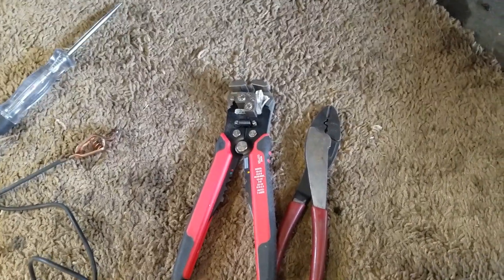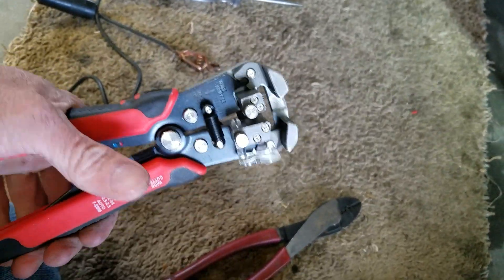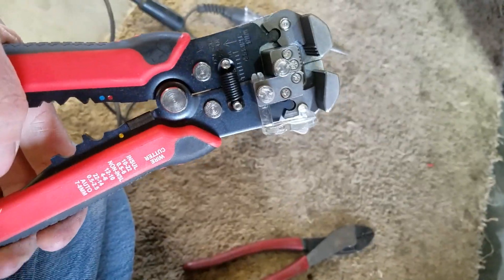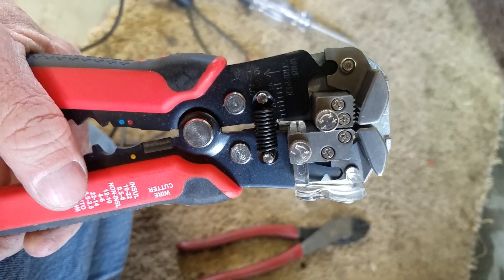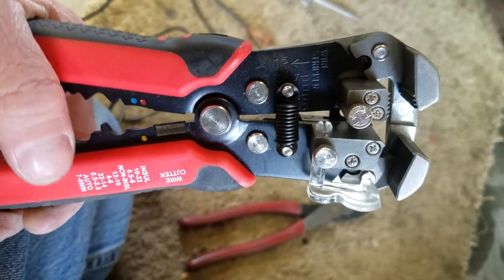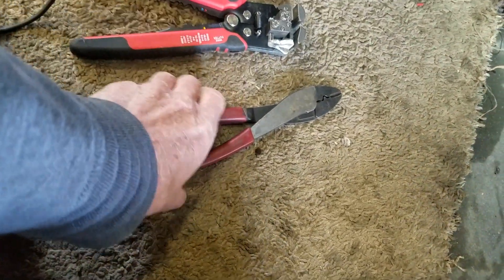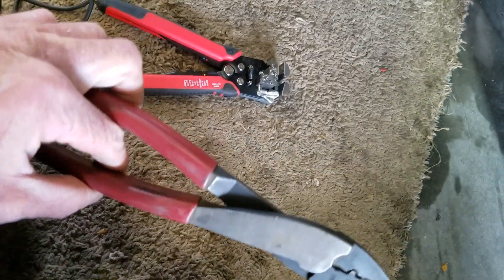The other thing you want is a good pair of wire strippers. There are different versions out there. This one I bought recently — I paid about 25 bucks for it at a car show from a tool guy. At the top there are two teeth like that — you stick the wire in from the left as far as you want stripped, you can adjust it with that little clear plastic thing, and then you just pull it apart and it strips the wire off. This one does almost any size gauge that'll fit in there, which is cool. These other ones I paid about 30 bucks at a home store like Home Depot or Menards in the electrical department.